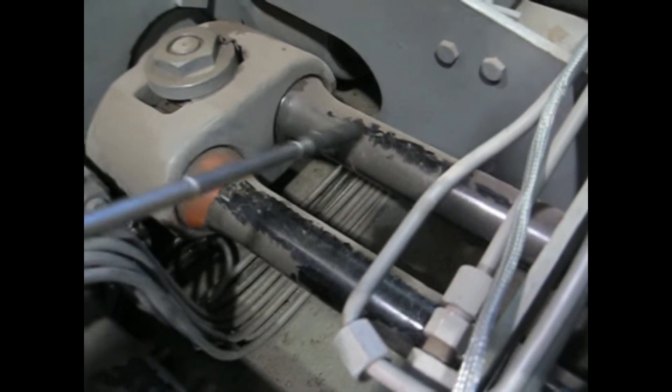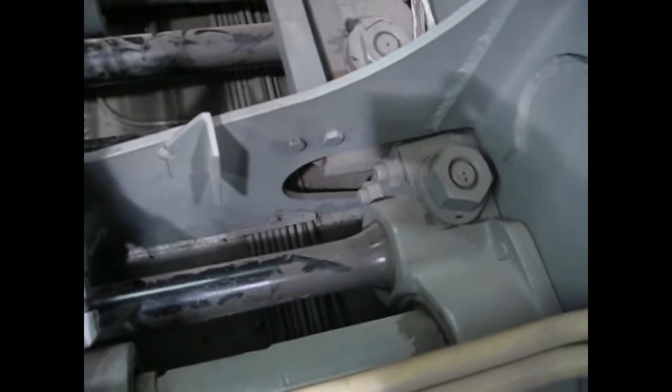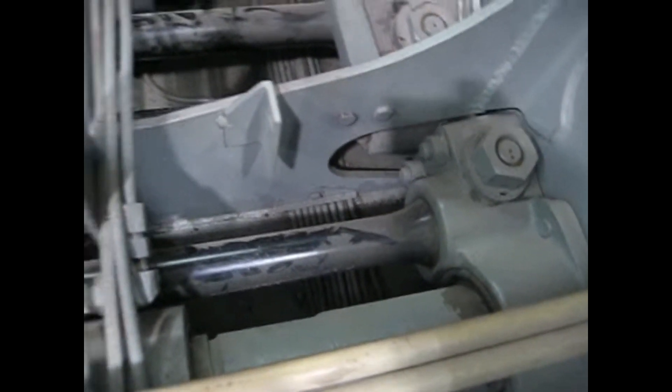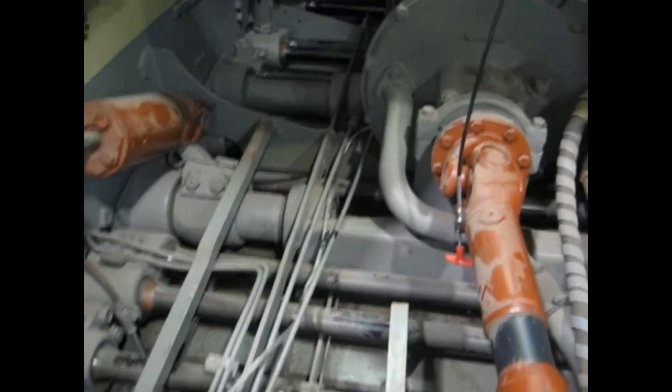My first pro for torsional bar: it is cheap and it is simple — two key attributes when producing these kinds of tanks. Something that is simple to replace, simple to produce, and fairly cheap. These systems are also quite reliable. If you know how to drive these vehicles correctly, torsional bars will not fail on you. It's normally when a driver or crew has not paid attention to how the vehicle handles and the terrain it crosses, creating too much strain and shearing them.